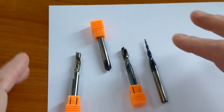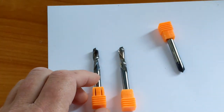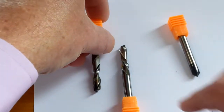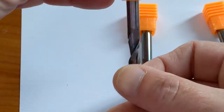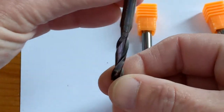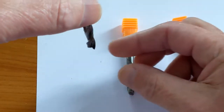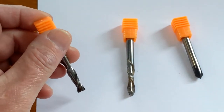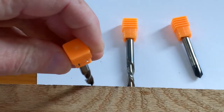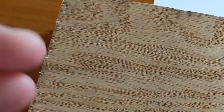The first thing you're going to need are quarter-inch end mills, and there are two styles: an up bit and a down bit. The router turns clockwise, and with an up bit you can see the flute spirals upward — as it cuts, it's pulling chips upward and out. But it's also ripping the edge of your material. Going across the grain, it leaves a rough edge and you have to do a lot of sanding; it kind of ruins a nice tight edge.